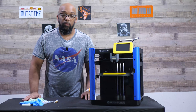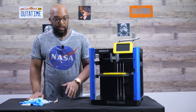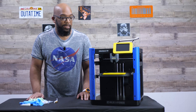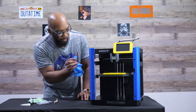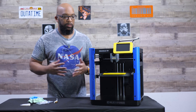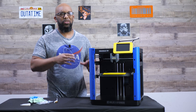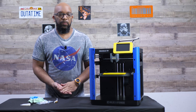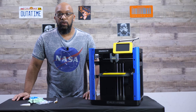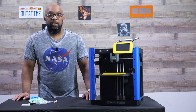This printer has been printing wonderfully since I got it, so I don't feel any need to mess with belt tension or anything like that. That's not to say there won't be a need for that in the future, but currently I'm not going to mess with it until something gives me an indication. That's just the basic maintenance for this printer. You could also go around to the screws on the frame and use your Allen key to make sure they're still nice and tight. Just keep it clean, keep it lubricated, and keep your nozzle clean and free from residue as often as you can — and the printer, barring any unfortunate mechanical failures, should continue to serve you well. Thank you all so much for watching — take care of yourselves and I'll speak to you soon.